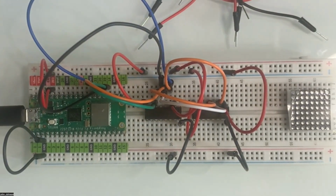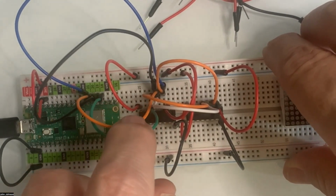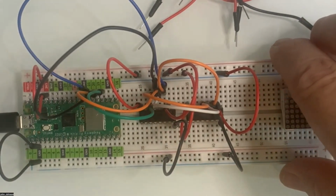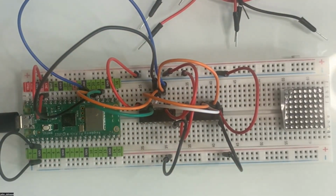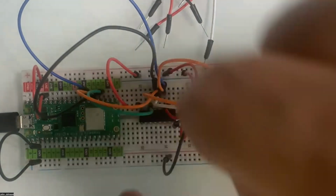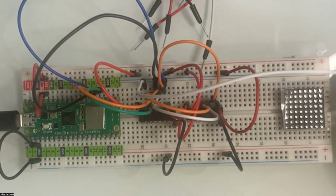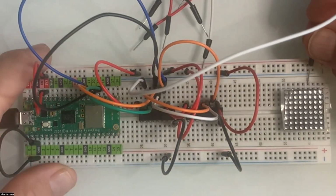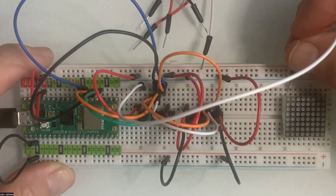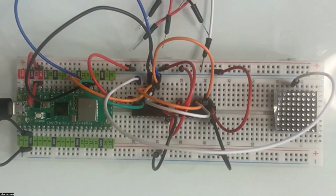So that's the top row, except you'll notice that we didn't fill in the second pin here. The second pin, if I can move that over without showing my dirty fingernail, is open there. We haven't put in the second, and that pin is going to go over to the LED, and that's going to go to the 4th pin of the LED. So I'm going to take a long white one to go from there. And I'll do it on the outside up here. And then I'm going to go over to the fourth pin on this. So we go to the 1, 2, 3, 4. This is why it's nice to start on a number, then I can just easily find the place to plug. So, there we go. So now we've got our entire upper side completed.